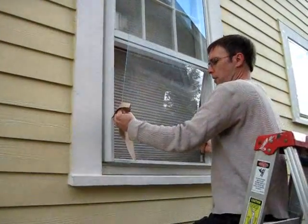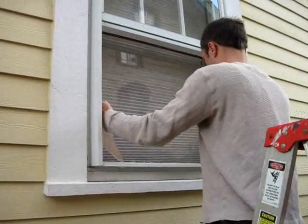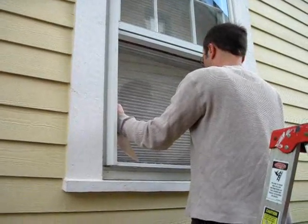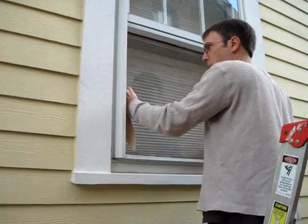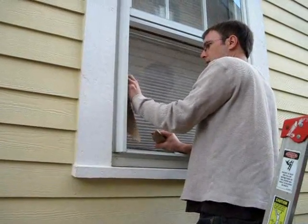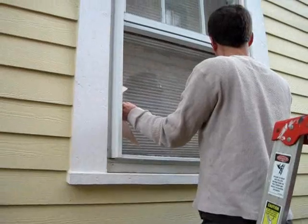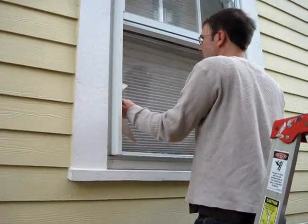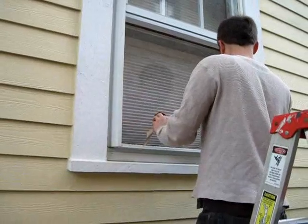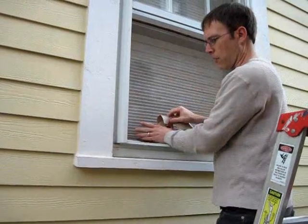I didn't remove the storm window — I figured that was just an extra step, so it'll make it a little more difficult. We'll see if this works. I cut it one-eighth smaller than what I measured to make sure it'll fit properly. Now the paper's getting stuck in there — hold on, just a second. Try this again. Be very careful — very easy to break these. And there we go, it fits. I have enough clearance up on the top, which is the most important, so it won't slip out. Now I'm ready to glaze it in.